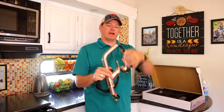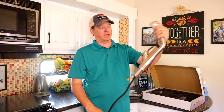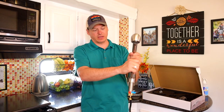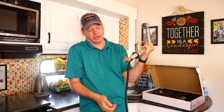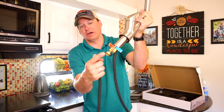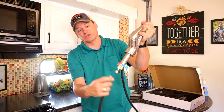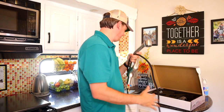We've got the actual faucet, and so this is obviously the reason that we got this thing, is because that will go in, and she can take it out and spray it. And so you can see pretty basic one lever control. This is the hose basically for this, and then you've got three connections down at the bottom. So you're gonna have your hot line in, your cold line in, and then this other one is actually the supply line that's back from the controls back to it, and so this actually connects here to go back up to the faucet.